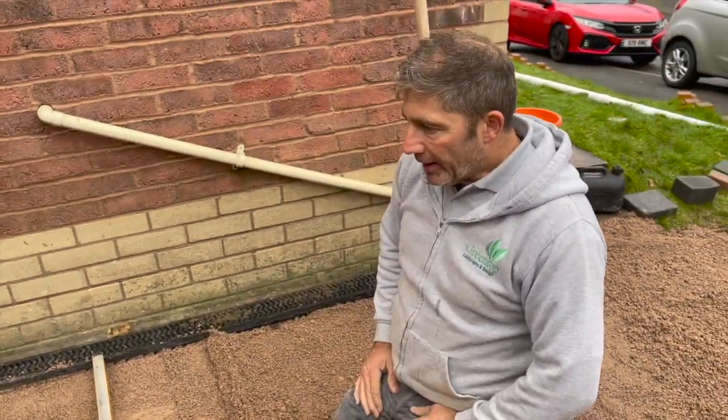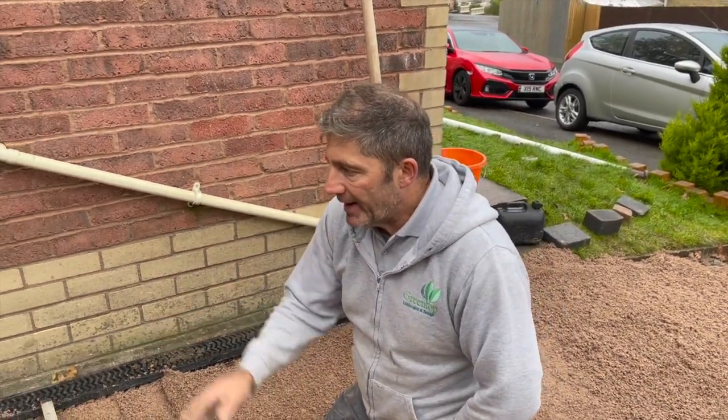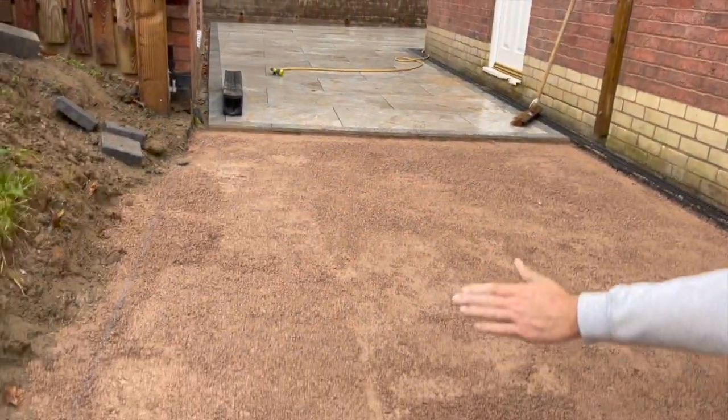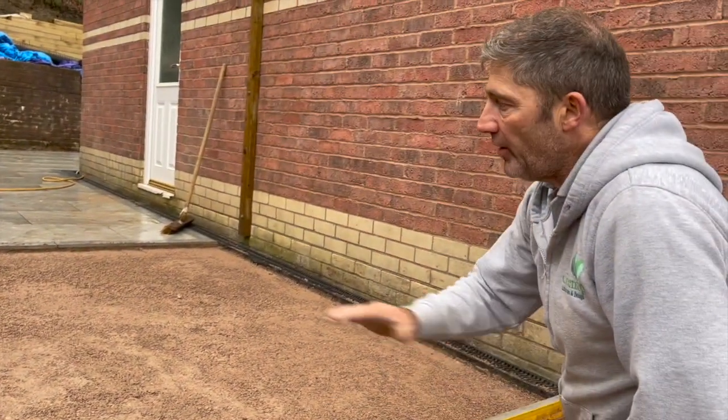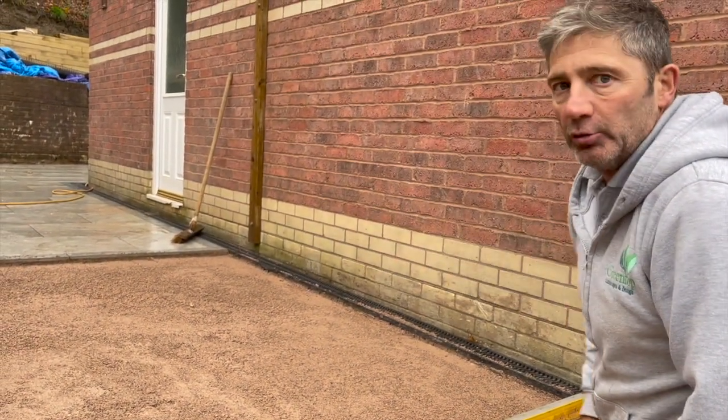Right, here we are. Just to let you know, I have got knee pads in, so I'm okay on my knees. So what we're doing here, if you want to have a look from this angle now, I'm just going over with the level. We've got a string line on that side, okay? And what we're doing, we're just roughing out, ready for our final screed.